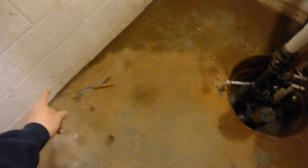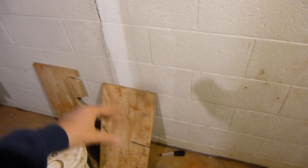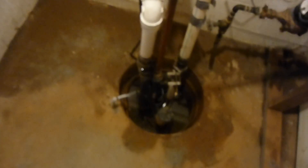More modern houses, they're plastic. Those tiles lead into the sump pit, so any groundwater that's in the ground underneath the floor or outside the wall will take a path of least resistance and goes into those hollow drain tiles, then goes over to the sump pump. The sump pump has a float on it, and it kicks on and pumps the water out to the outside of the house, away from the house.